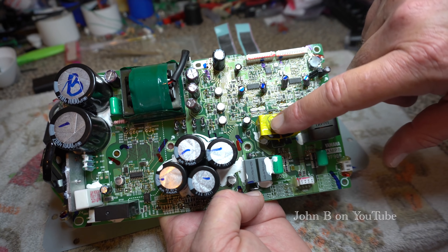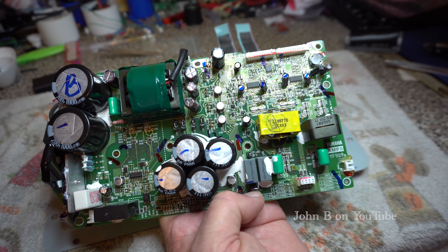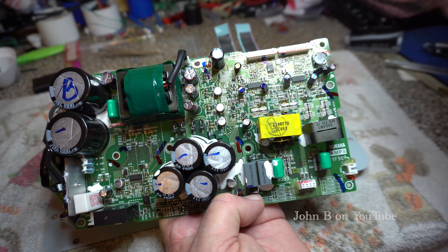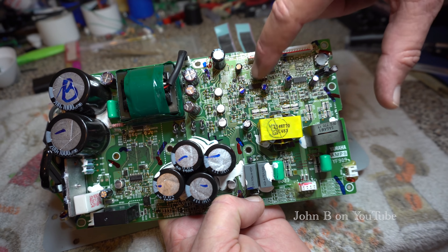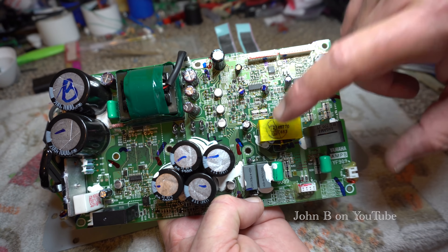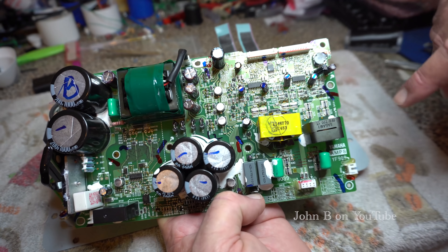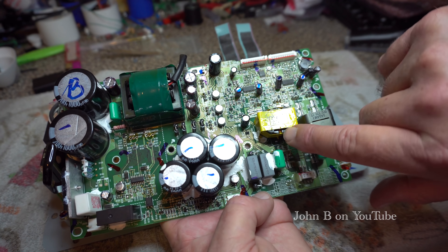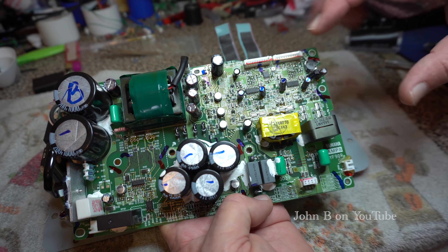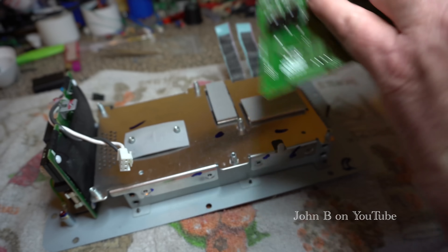You have to take that 400 kilohertz out before it gets to the speaker. So I thought, why are there two coils? I had a look at the circuit drawing quickly, and these two chips there — which are identical to the PV1600 amp — these are 500 watt class D amplifiers. So they've got 500 watts for the bass and 500 watts for the treble. I think that's the treble and this looks like heavier grade wire for the bass. So they're the drivers for the amplifiers for the bass and treble.